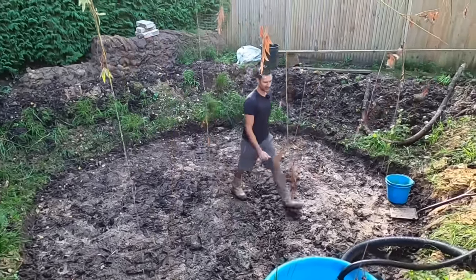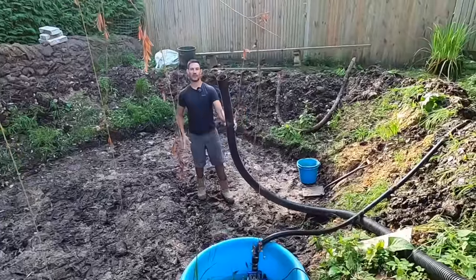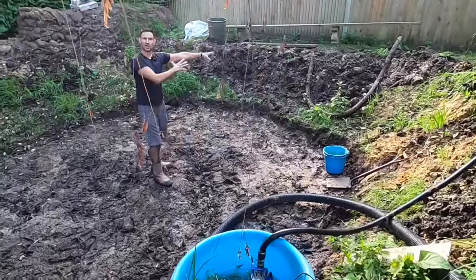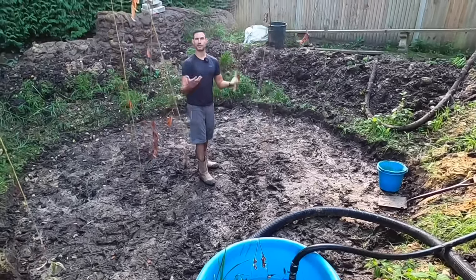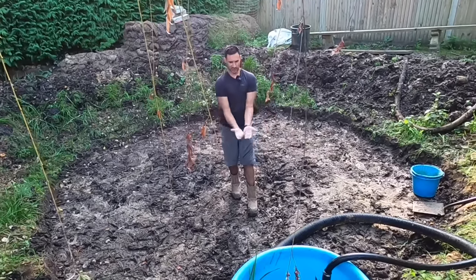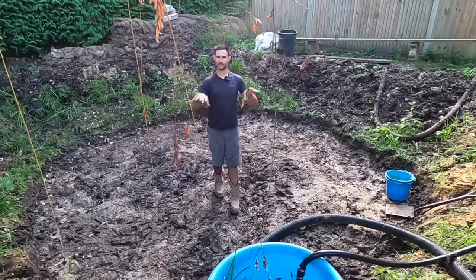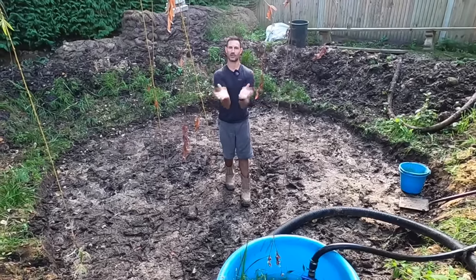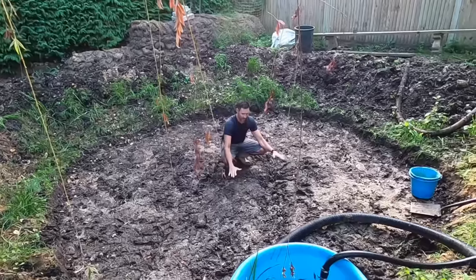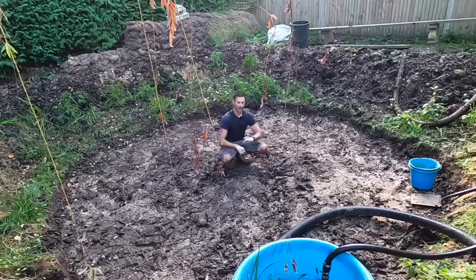But I've got to be careful because in the base of this pond, we're also going to put a length of leaky pipe, a way of collecting potential groundwater that might get collected beneath the pond liner and giving it a way to discharge safely away from the pond so there's no risk of liner lift. And I want to make sure that this package, which is going to be a small trench lined with a permeable membrane, a little bit of gravel, some leaky pipe, a bit more gravel on top, and then folded up with this membrane, has its top at the finished level of the stonework. It can't be buried beneath a stone, and it doesn't want to be proud above it because then it will be visible with the pond liner.